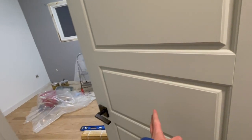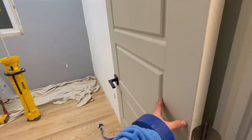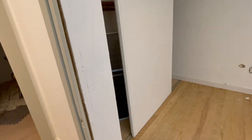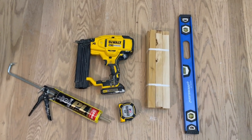The way you choose your swing is by standing on the outside of the room and stepping into the room, looking left and right. There's no right or wrong way to swing, but you should consider: if the door is left open, is it in the way? Will it back onto a dresser or tuck nicely into a space? To install the door you need a pack of shims, adhesive, a level, a nail gun or finish nails, and a hammer.